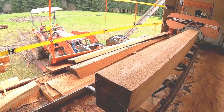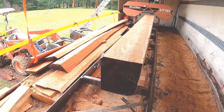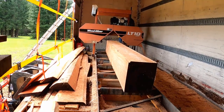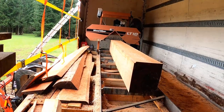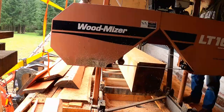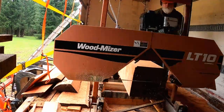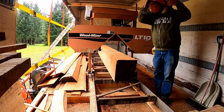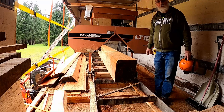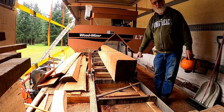That's one thing you need to know, what kind of lumber you're going to need. Because this is cedar, it'll make great siding. So let's go ahead and mill this up into 1 inch. Just like that, you can stack them up. You gotta stay out of the throat of that, so depending how wide your wood is, you can only do so many. So I'll go ahead and throw these up on the rack.